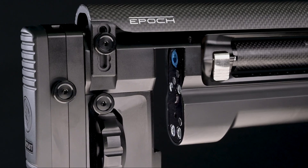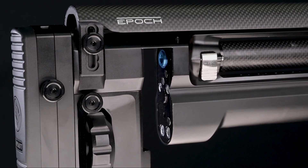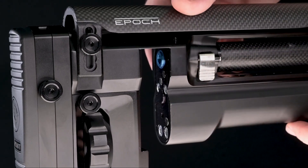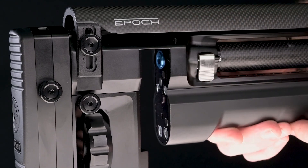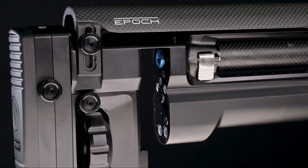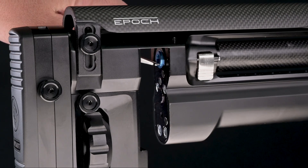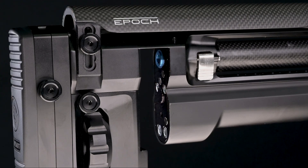Looking from the magwell forward as we install that barrel pushing through, we want to make sure that there's no gap between the barrel and the block, then double check that our lock is as tight as it can be. Visually, inspect the base of the barrel to make sure that the upper ridge does protrude and the lower ridge is flush with the breech block.